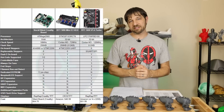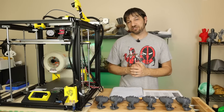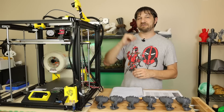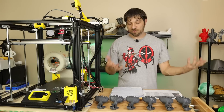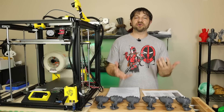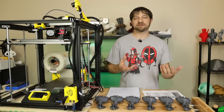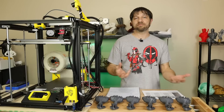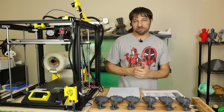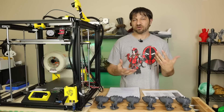I tested all three boards in my Ender 5 Plus, which has filament runout detection and a BL Touch — both worked without problems on all three boards. When it comes to upgradability, that's where the differences really come out. On the Creality Silent board, the only real upgrade option is an unused stepper motor driver for a second extruder or to separate the two Z-motors. The 8-bit processor, as shown in my Marlin upgrade videos, is already maxed out with very little room to add firmware features.